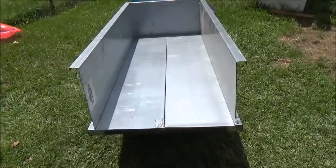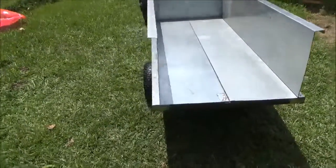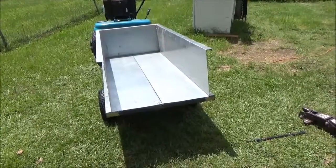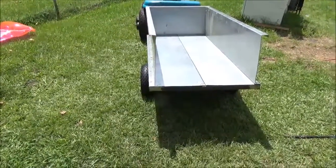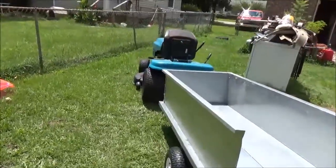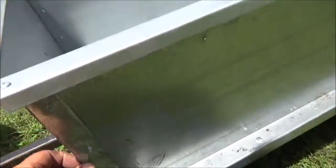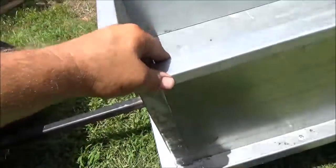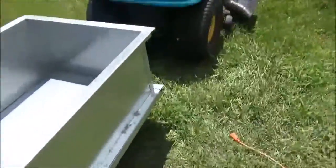Yeah, it's narrow, but you can't find a garden trailer or wagon cart much wider than that. Like I said, I can always throw something on top and make a go-bed. I got a few little bits and bobs I want to do — grind off the rough edges, fill in some holes. What I did up here on both sides: I ended up folding this piece over, notching the other piece, tucking it under there, and putting the screw through it, which really tied it all together and made it as strong as it can be.